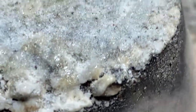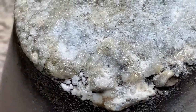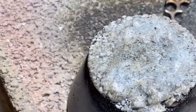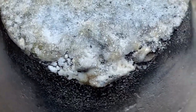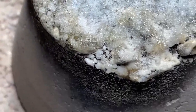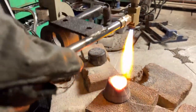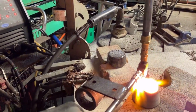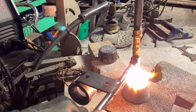We got a nice little frosty glass coating on there. Now I could have gone back over that again and vitrified this powdery layer a little bit more - but the question is, do you want to do that? If you turn it into a solid amorphous lump it'll crack when exposed to heat. I decided to fire the torch back up and vitrify that layer again one more time just to seal the deal. I wanted to see how glassy I could get it with just a quick little taste - I didn't want to hold the torch on there too long and cause damage to the substrate.